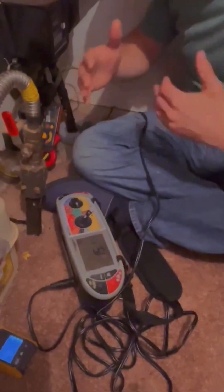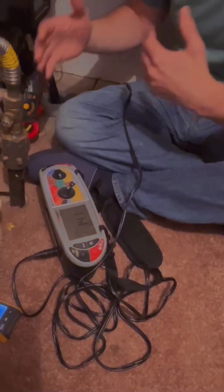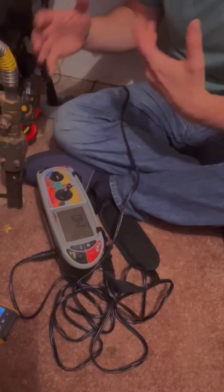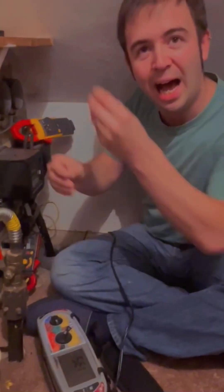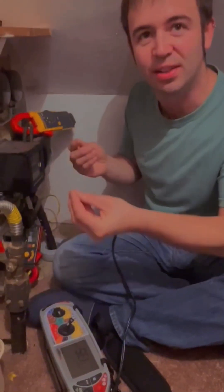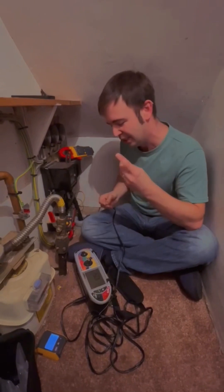In a few years — maybe 10, 15, or 20 years — that diverted neutral current will eventually cause a break, or the cable will deteriorate so much that dangerous voltages will appear. If you get a full broken PEN conductor in an installation, and if it's on three phase it would be even more dangerous — almost 400 volts.